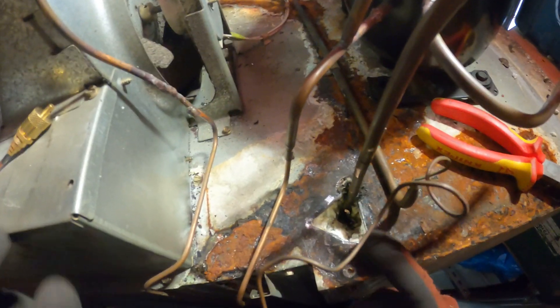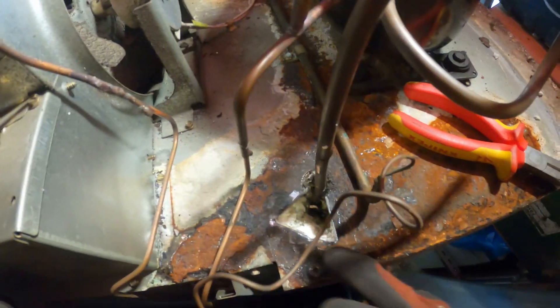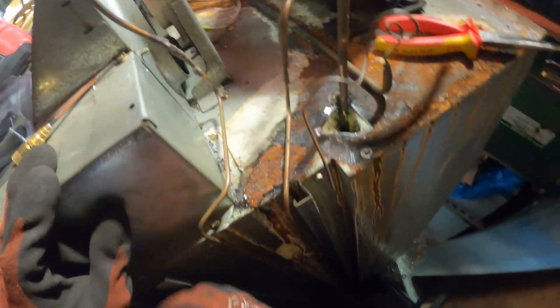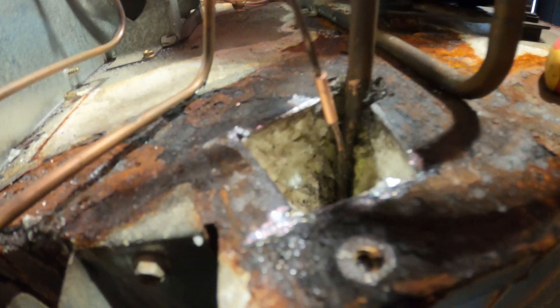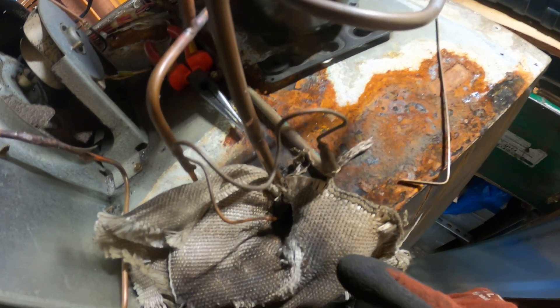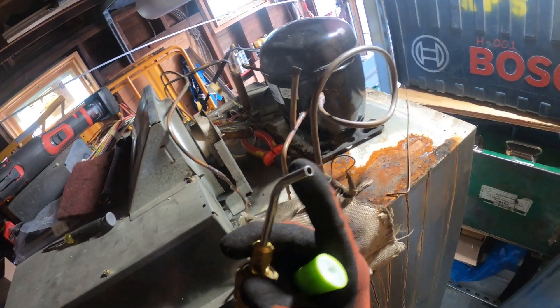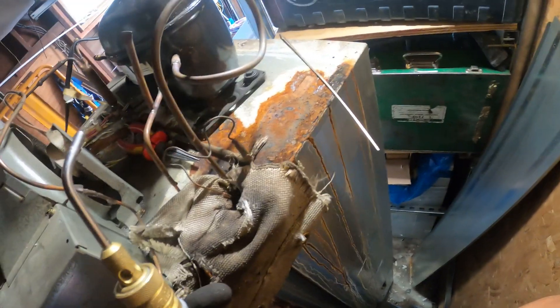I hope I can get more access here — if I can just cut this somehow, I'll braze it. I do see a little bit of oil down there, which is not good. I want to cut this up and use it as a coupling. I've got a fireproof mat around the area. I have the smallest tip for my torch and a 15% silver brazing rod. Here goes nothing.